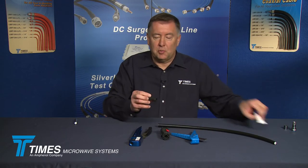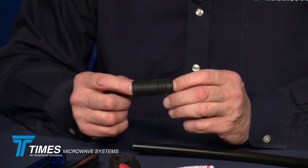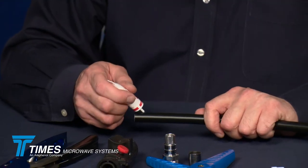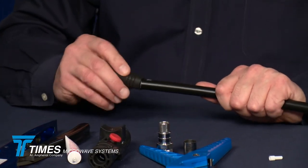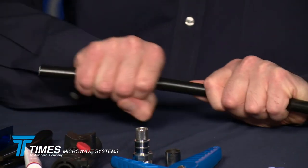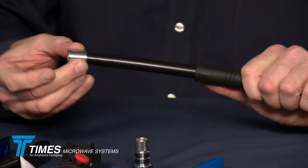At that point, we're also going to demonstrate our WSB-600 boot — it's a strain relief boot, an IP67 sealed boot — along with our X-Series connector. The first thing we're going to do is put a little drop of biodegradable silicone lubricant on the cable. This stuff dries very quickly and doesn't leave any residue. Take the boot in the proper orientation and slide it onto the cable. Then take your crimp ferrule and slide it over the cable.